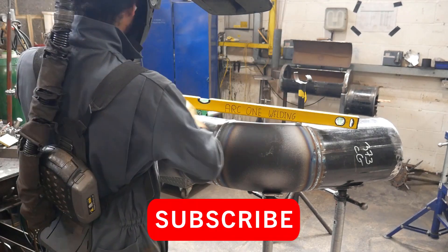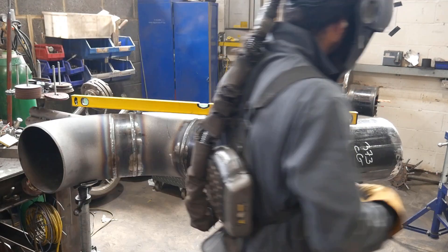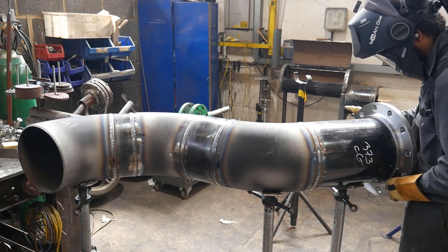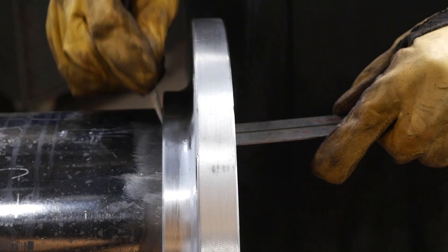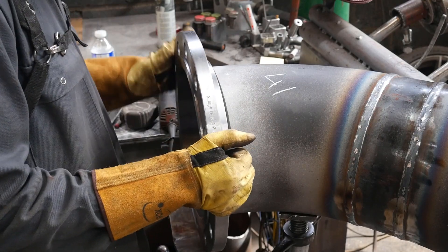Checking the overall length on a piece of pipe like this is usually difficult and it's a gamble, because the measurement you have could be off by up to 10mm or 5mm purely because the cut isn't straight. But in my case I was able to check it and it worked out bang on. My flange needed to hang off 15mm, so I use a steel rule to pull the flange out 15mm.